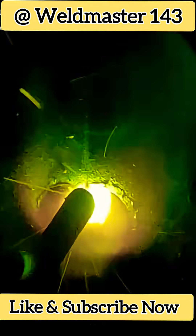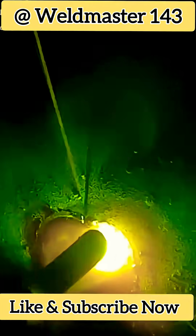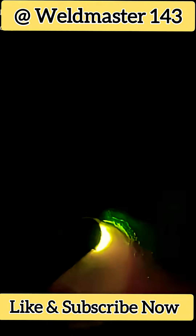While welding, make sure to burn into both sides a little more and just pass through the middle. Keep the electrode aimed right at the center of the seam — don't go off track. In a moment, we'll check the molten pool and the weld bead.